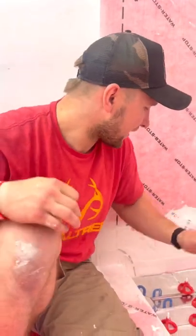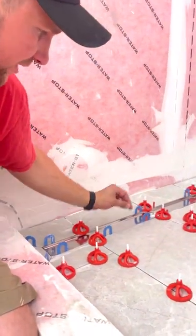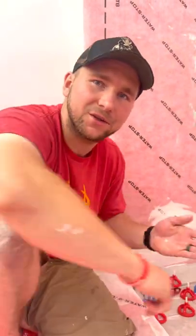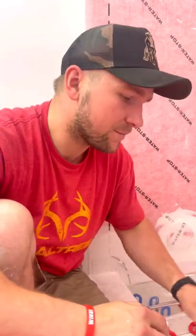We're all done. Last thing you want to make sure is that your drain is at least a sixteenth of an inch below your tile — this way water just falls right into it. You don't want your drain above your tile because then it's going to be pooling up there. Literally if you're going to do any type of tile the process is exactly the same. Make sure that your tile is honed so nobody slips. I'll see you on the next vlog.